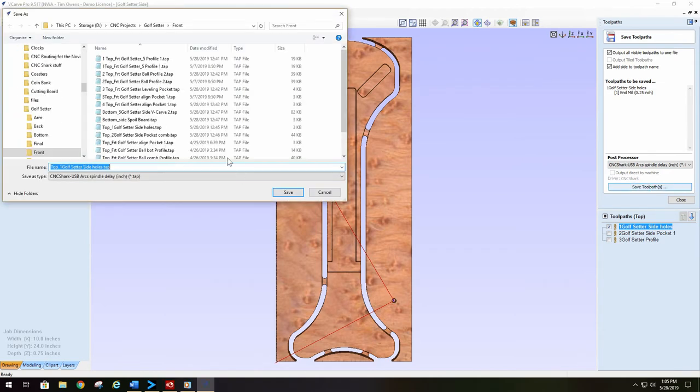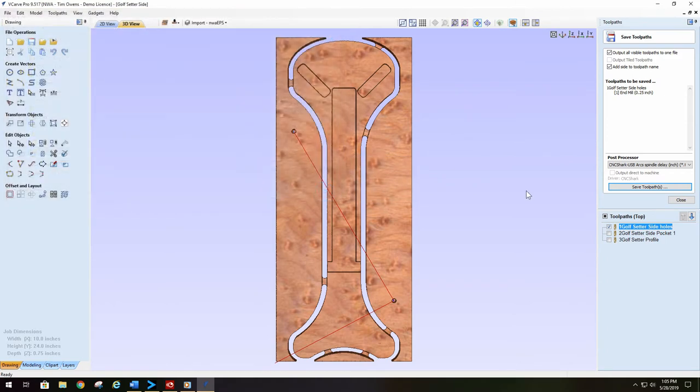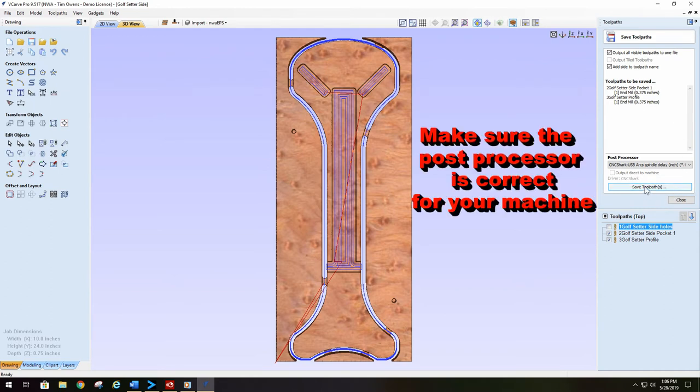Save the tool path. I've already got a unique name. All I have to do is go and save. It says you already got one. I know. I saved one already. So, I'm done. Then go to the next two. You notice if you don't take off the quarter inch one, it tells you you have different tools. Take it off. Now I can run these two tool paths.